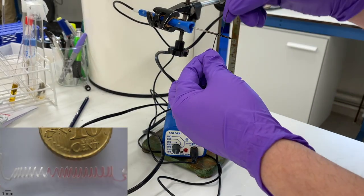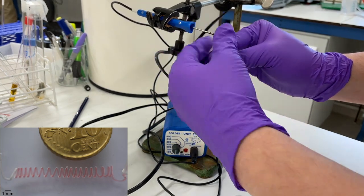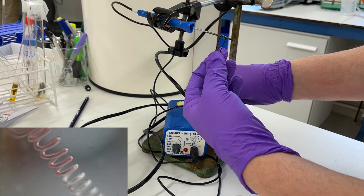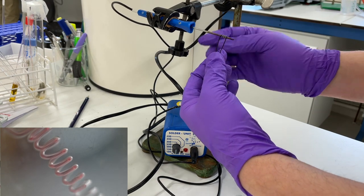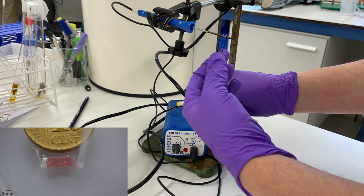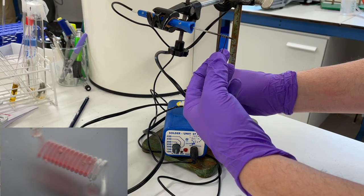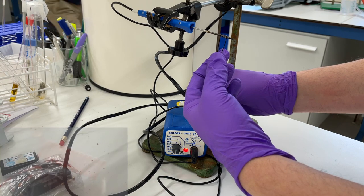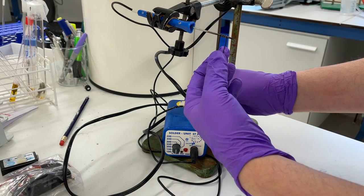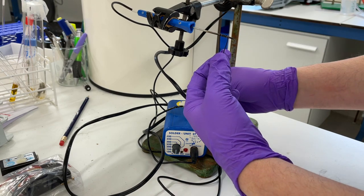Many people ask how to make the coil microfluidic device. I'm still using the same soldering iron — I just make the coil on top of a cold soldering iron, then turn on the heat and wait until it gets the shape I want. When it melts, I keep the ABS in the same position, turn off the soldering iron, wait for everything to cool down, and I have my final coil shape.